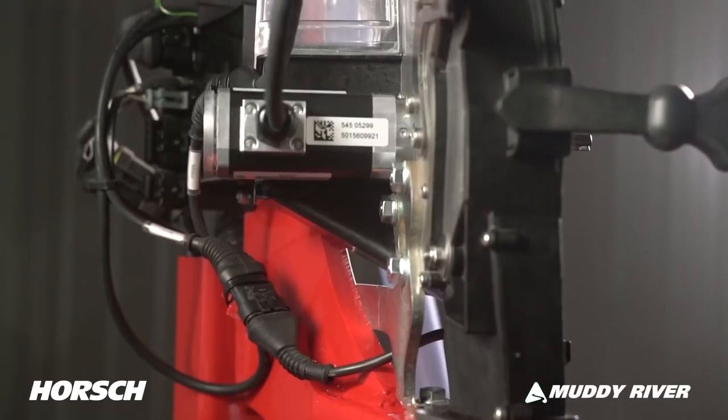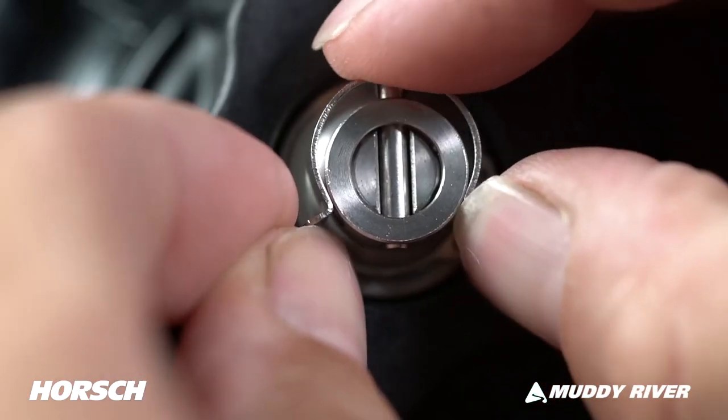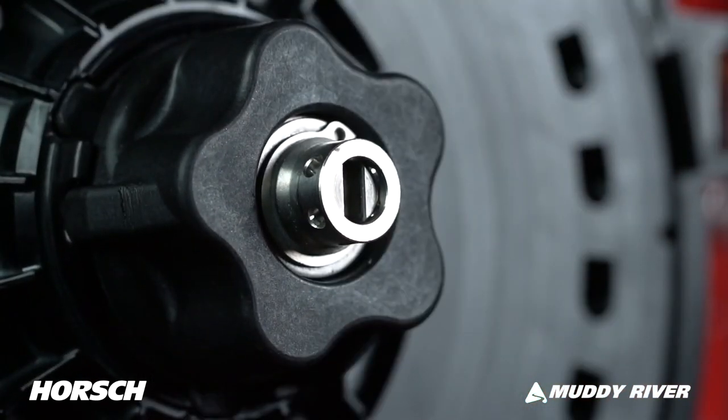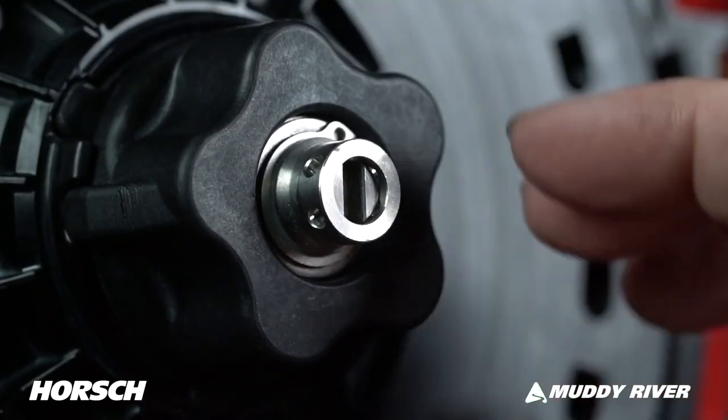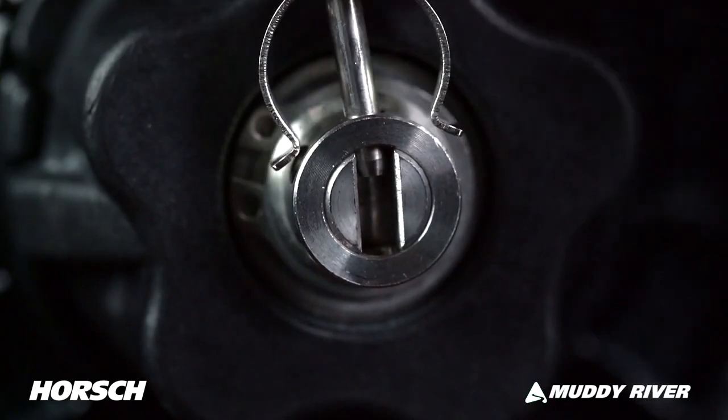Center positive drive technology eliminates the risk of outer gears wearing or loose tolerances which can affect seed release quality. Disc shimming is a simple and fast adjustment on the air back metering system — simply remove the hub clip and slowly rotate the adjusting hub either in or out on the center drive shaft. Once proper tolerance has been set per your owner's manual, simply reinsert the hub clip. By using a threaded center drive shaft, the need for taking off a disc and removing or inserting actual shims is eliminated.